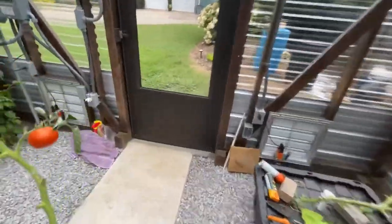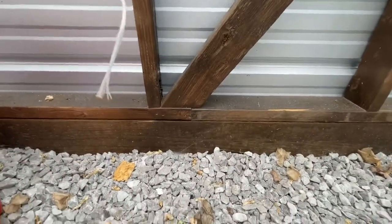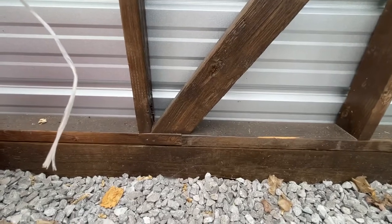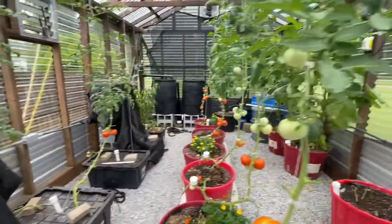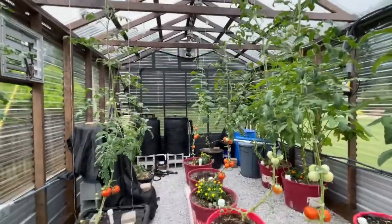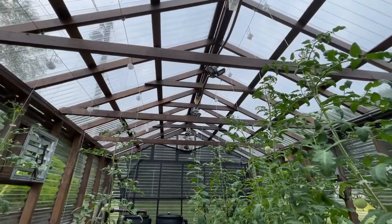The hardest part to me was getting everything squared. I cleared this base and used a 6x8 post as a base all the way around, then framed my walls on top of it. I did some concrete pillars underneath in certain spots, especially the corners, so it's off the ground. Then probably the roof by myself — anytime you're dealing with roof rafters and pitch and all that, that was probably the toughest part.